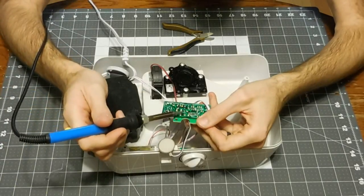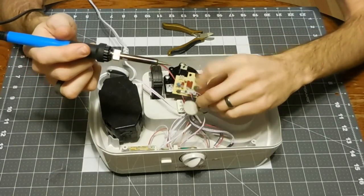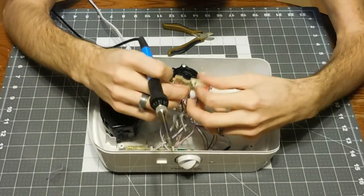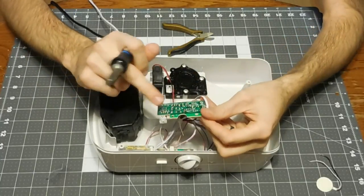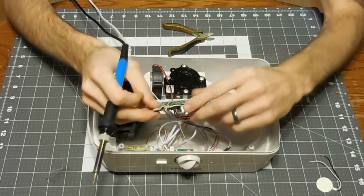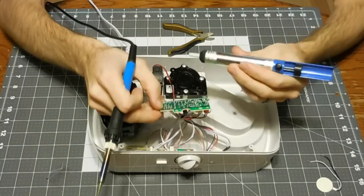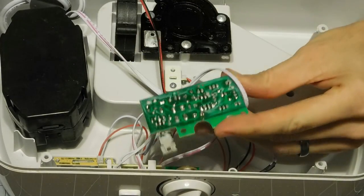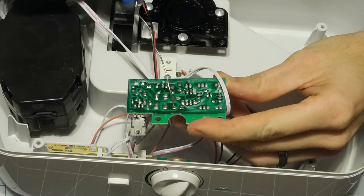Now I've got my soldering iron. From the bottom of the board, the black was on the left — with me looking at it — and the other color was on the right. I've also got a solder sucker just to clean some of the old solder off. Looking at the bottom side, here are the two holes that the ultrasonic piezo was soldered to — black on the left, the other color on the right.